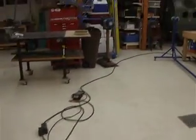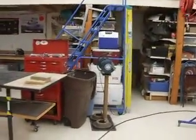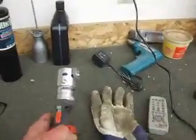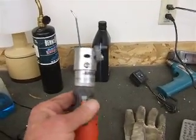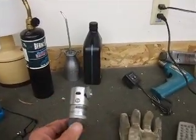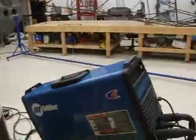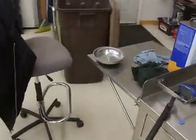I take them over to my fine grinder that I use for sharpening my tungstens. I grind all the goobers off, and then I've got this Sharpie that I bought from Arc Zone, and I'd polish them up with that, and it was really nice. This old TIG tungsten grinder is not a necessity. It's really a nice accessory. Don't have to have it. I just have a fine grinding wheel on my grinder that's dedicated to tungstens, and that works just fine. It's just that the other one seems, for me anyway, more consistent.